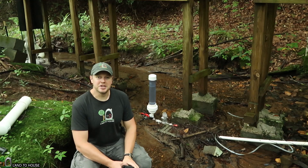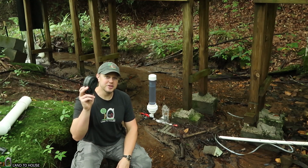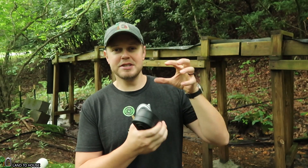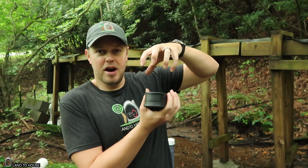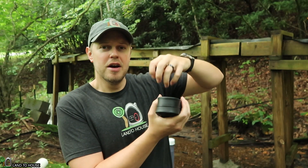In this video, I want to talk to you about bicycle inner tubes in the pressure tank. The concept behind the bicycle inner tube as a tank fill is that it creates a bladder or an air space that is constant inside of the pressure tank, because over time the air will absorb into the water and the available pressure area goes away.